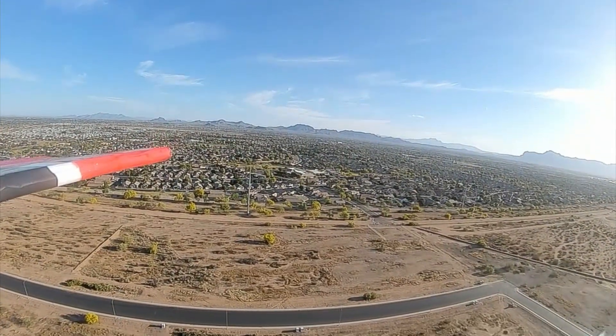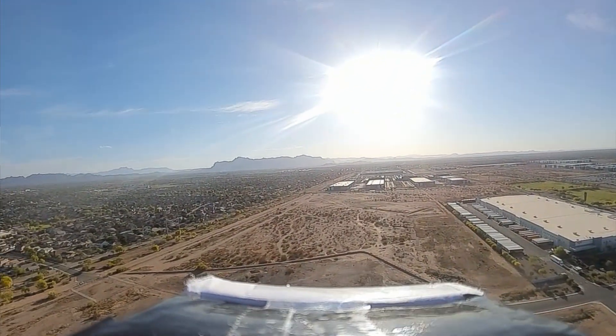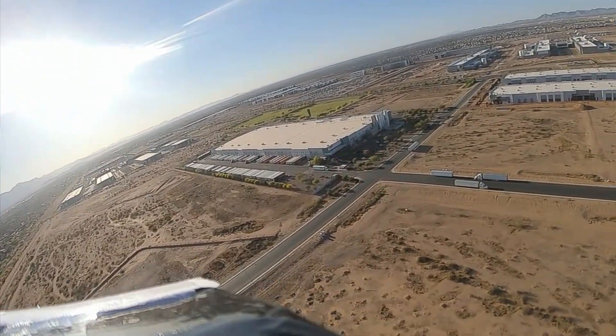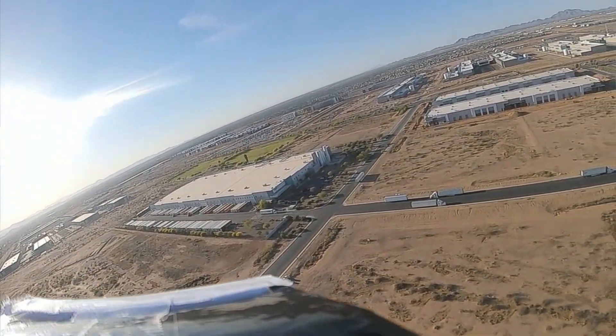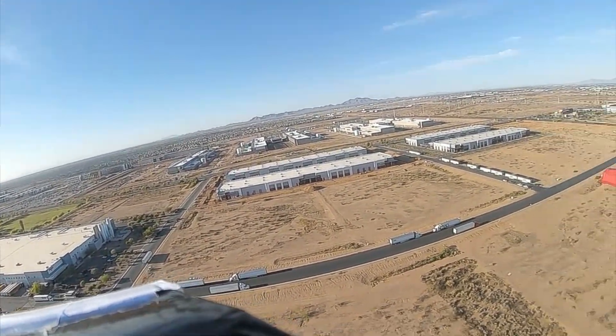My OSD on this one — I'm using a light version which only gives me voltage. I don't have GPS, altitude, or a barometer. It's just reading the voltage off my flight pack. Right now, with a couple of short line-of-sight flights previously, I'm nearing the end of the pack — and this is the 1300.